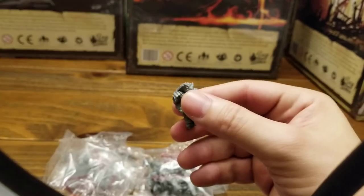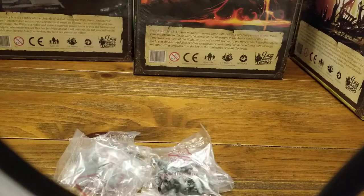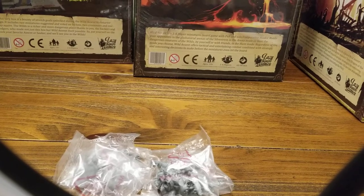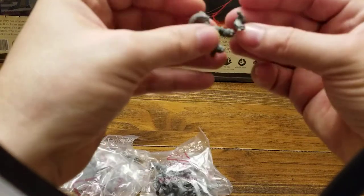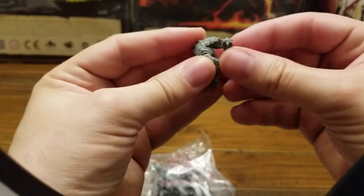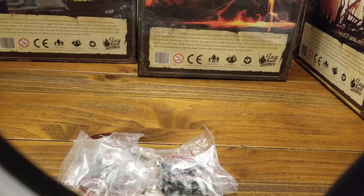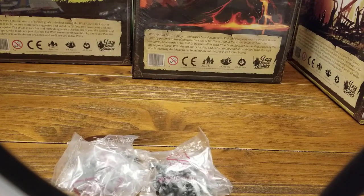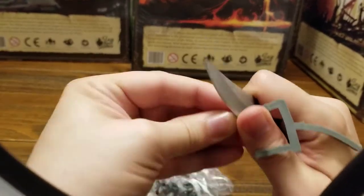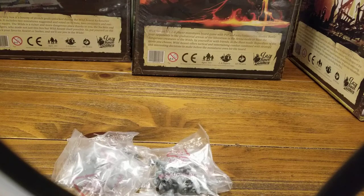Bam, we got a head! All of these are on the joint, looks like, or really close. That one's not - we have to be careful with that one. So what I'll do is cut it off way up high and then file it. That'll be perfect. That's an L-shaped joint. We're in - it doesn't want to hold particularly well, so it's not a nice fit, but it's a fit. This one's the same way, gonna have to cut it up high and file it down. That actually worked out pretty well.